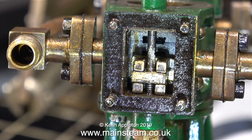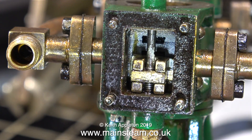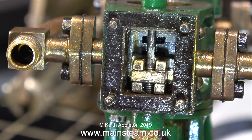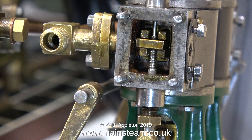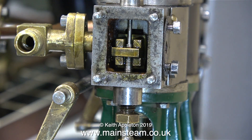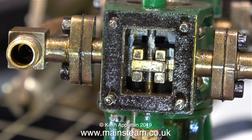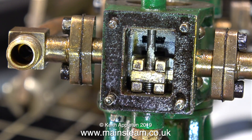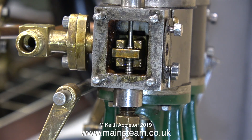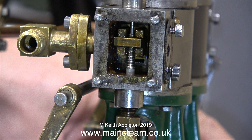Back to the job. That other engine is okay in one sense — it had a damaged crankshaft, but the valve events were always fairly good. In this episode I'm not going to give you the solution yet. Here's the other engine I'm working on, showing the valve in the steam chest — it goes up and down and uncovers the ports. Now here's the one from the Netherlands: it's a bit dirty and oily and not very well made, but as you can see the valve also goes up and down and uncovers the ports — yet this one doesn't work.